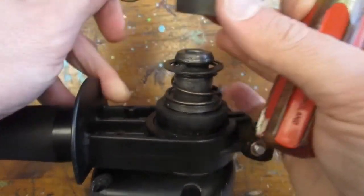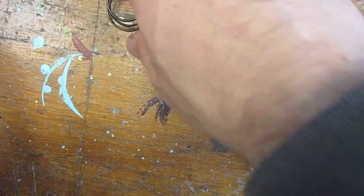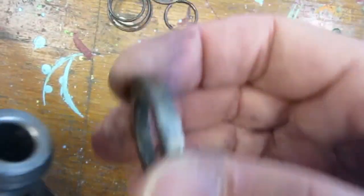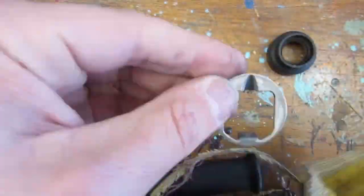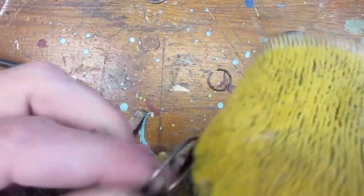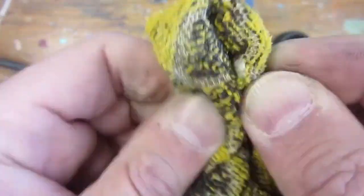At this stage, I knew there was something wrong, as some components were not in the place I expected to find them — starting with the spring being upside down. Since the SDS locking and unlocking mechanism is based on a floating metal ball, I'm also cleaning everything thoroughly to remove any gunk and debris that would interfere with the free movement of the ball.